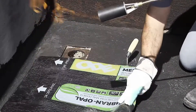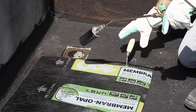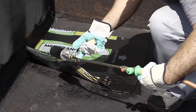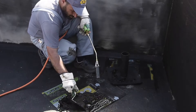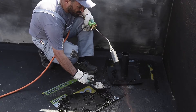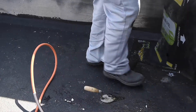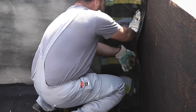Membrane pieces, minimum 50 by 50 centimeters, must be adhered to the application by centering the rain outlet. The vertical rain outlet must be adhered to its place after being covered with bitumen from a melted membrane piece. For vertical corners, pieces of membrane must be cut in proper dimensions and adhered with a welding torch so that an inner corner can be achieved.